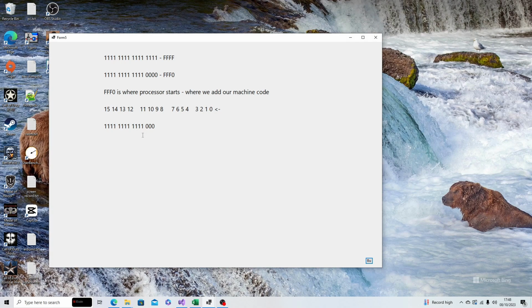In fact, because we've switched these addresses, this piece here actually becomes the 4th bit. So this needs to move across, and the 16th bit, the A16 line, comes in at this end. So they all shift across. This one will become onto here, so we'll actually get 1, 0, 0, 0, and the 1s and the 1s. So it'll actually look like that. The bit that was here, which is the 5th bit, has now moved across because we've dropped off the A0.